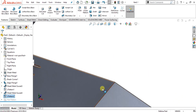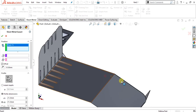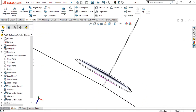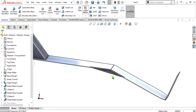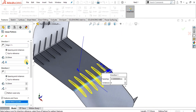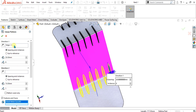Use the same feature for these two faces of the bends. Again go to sheet metal, select the sheet metal gusset, select these two faces, and we are going to add the rounded gusset. Select OK. Now you can see the indent has been made and the sheet metal gusset is ready. Go to the feature tab, select linear pattern, select this edge, select the feature, and increase the instances to 6 or 7. Select OK.